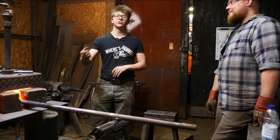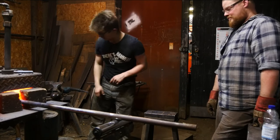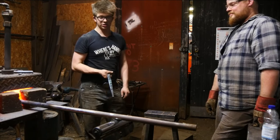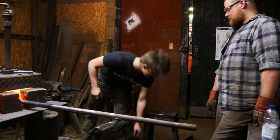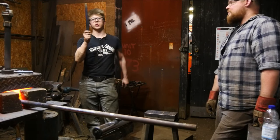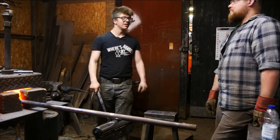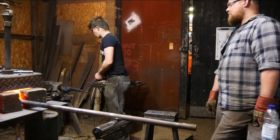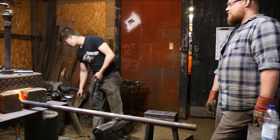We drilled the hole first. We drilled a 3/4-inch hole, a 20mm hole. That's how we started, and we got ourselves a drift right down here, which has been doing a marvelous job. This is just a 1-inch square drift. Fits through there nice and nicely. And this is made out of EN24 steel. You can use mild steel drifts. You might want to make 2 in case one gets a little more messed up. And if you use a mild steel drift, make sure that you're keeping it cool a hell of a lot more cautiously than otherwise. That would be important.